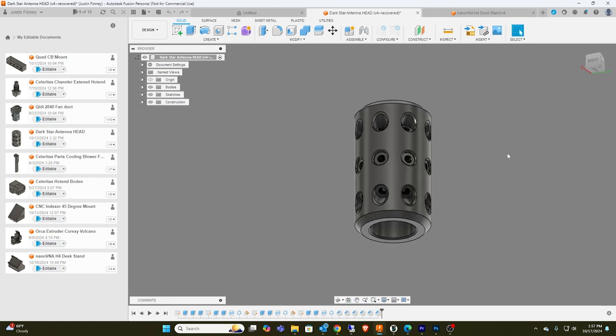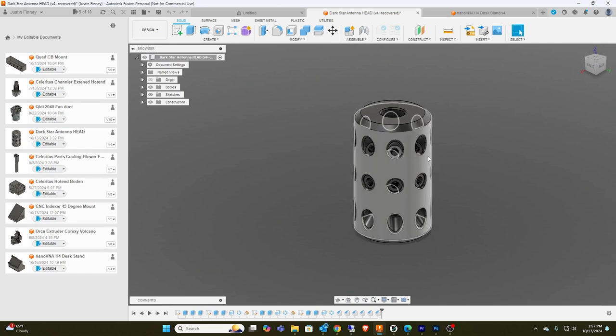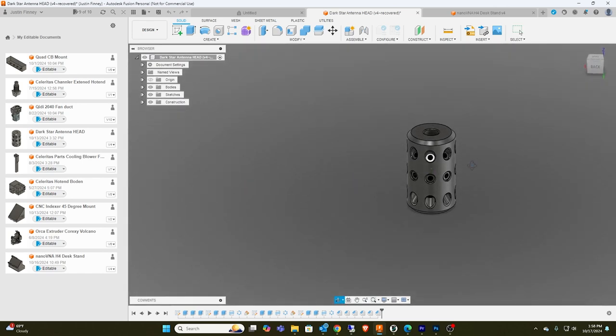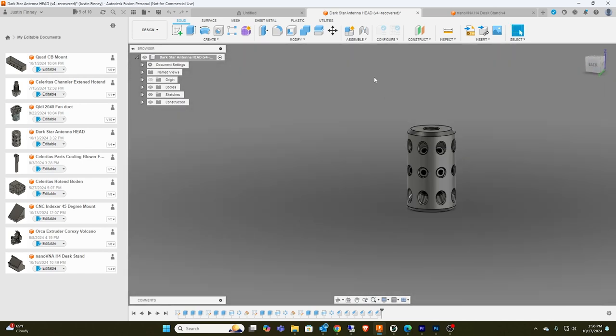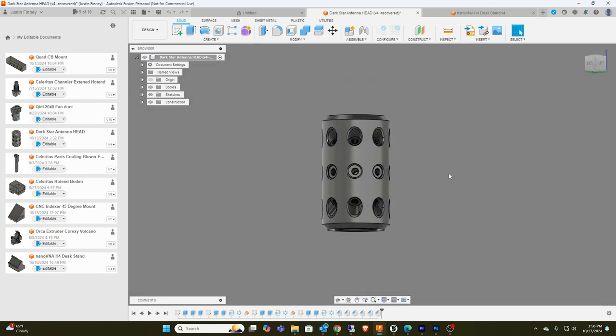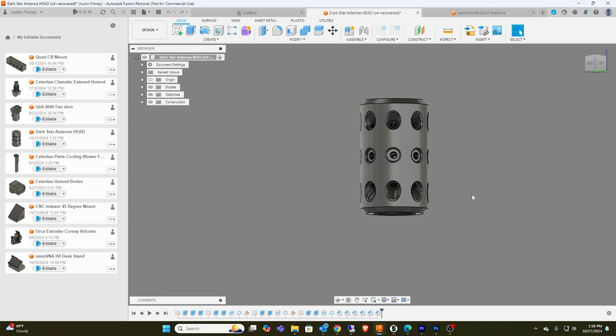That's why I wanted a really good network analyzer or antenna analyzer, so I could see what the changes I was making were doing to the SWR and the internal resistance and that kind of stuff. I know you can mess with the capacitance by having upward sloping radials. Even moving around obstructions, you could create a radial pattern that maybe helps the antenna go around obstructions.